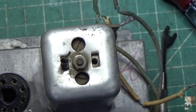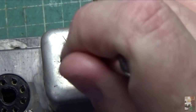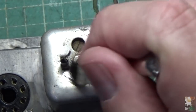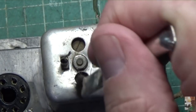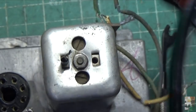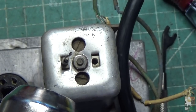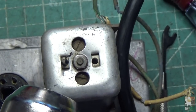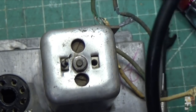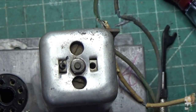It's not always easy — sometimes you've got to rethink it and go with something simpler instead of re-engineering and taking risks, which I don't want to do here. I'm going to take the heat gun now so the heat shrink doesn't slip down any further. We'll give it a shot and make sure it's nice and secure. There we go — all done. Successful repair. We now have this wire protected and insulated. That's how you do it sometimes.